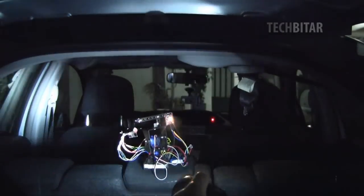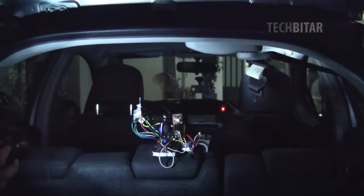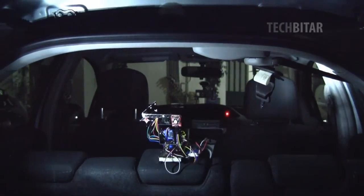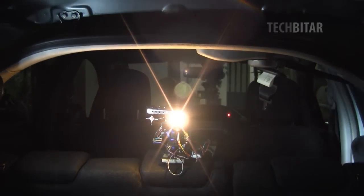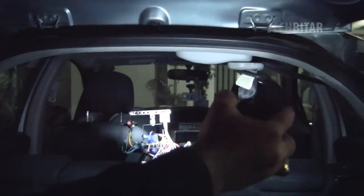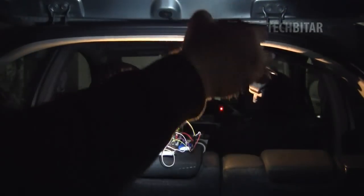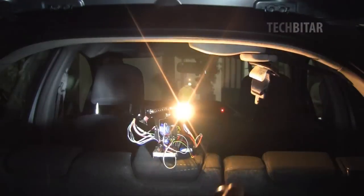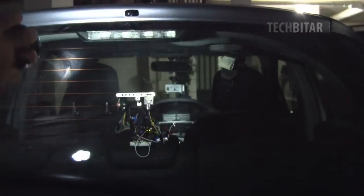What it is — it's an Arduino-controlled gizmo. You have a pan-tilt servo mechanism, and this pan-tilt servo mechanism is controlled by five photoresistors. Those five photoresistors identify and track the most intense light source facing them, and of course they evaluate light in four quadrants and compare it to the center photoresistor.